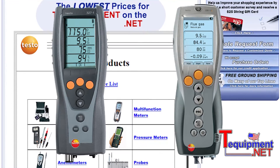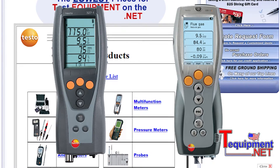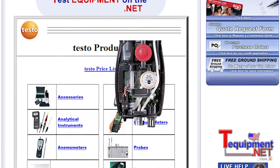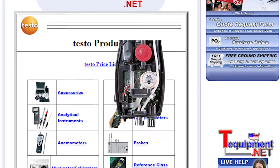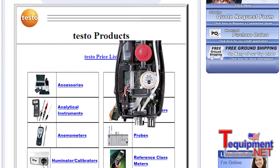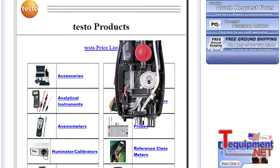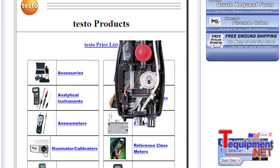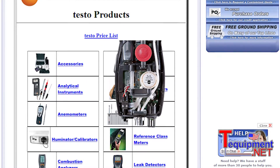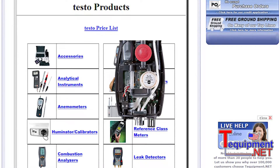The big advantage with Testo over the competition is that Testo has, since we've been in the business, pre-calibrated in-field replaceable sensors. With most other competitors, you would need to send the analyzer back for service to have the cells replaced, to have them calibrated, and then returned back to you. And often this can be, from other competitors, about a three-week turnaround situation. With Testo, because we build the calibration data onto the EEPROM of the board here onto the sensor, it is a true plug-and-play sensor. You can just order up sensors, plug it in. You're up and running, no downtime with the Testo combustion analyzer.